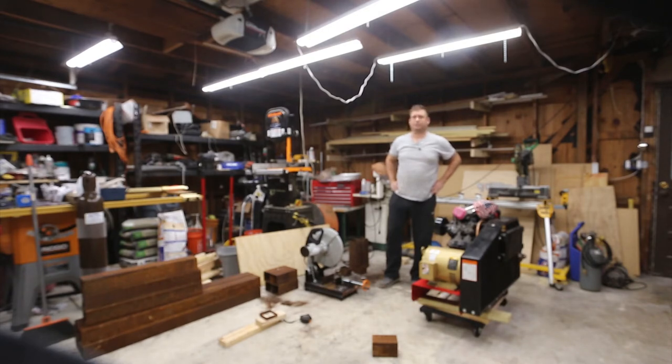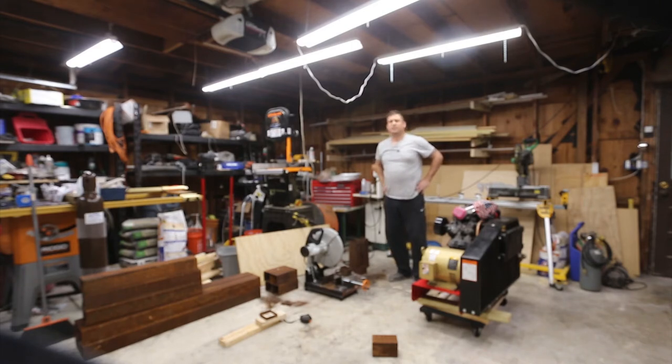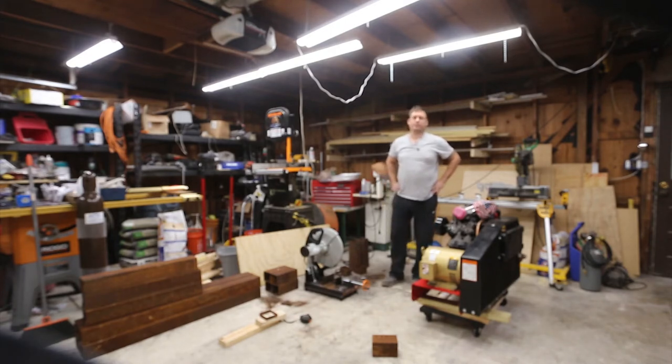and quite frankly, if I had measured a little differently, I probably wouldn't be an inch short, because I have some cutoffs over here, but once you cut the metal, you can't really put it back together. You could weld it, but at any rate, what I'm going to do is recut the other three uprights and make them 29 inches tall, and it'll just be an inch shorter than I was originally planning for it to be.